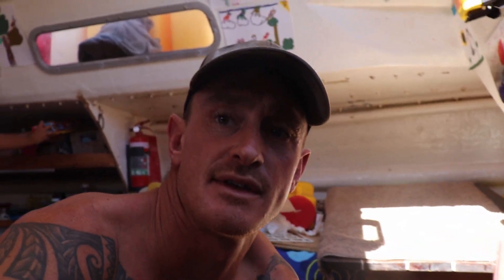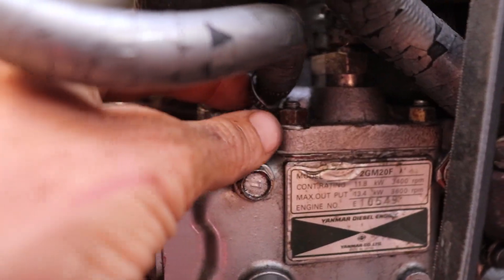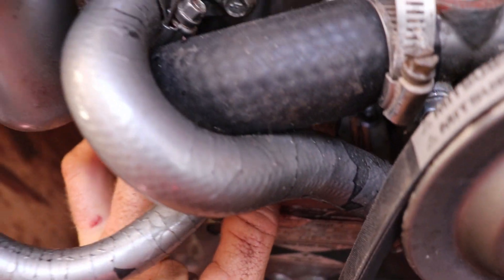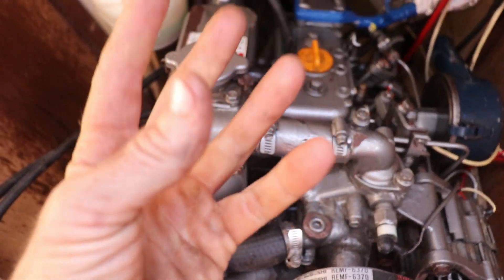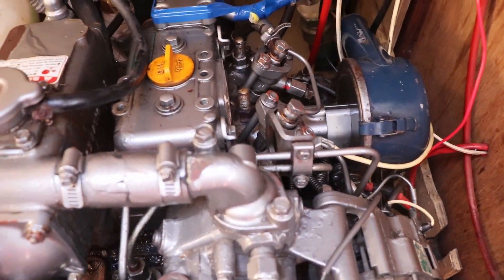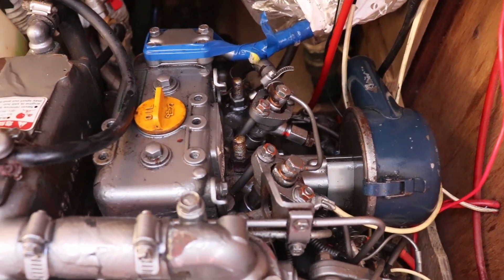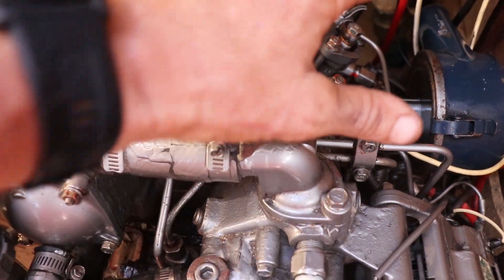So this is the basic rundown that I didn't really include before. When we had the runaway motor coming into Exmouth, I thought it was the injectors and the fuel injection pump. On these little Yanmars, that's the fuel injection pump - this thing under here - and you take those four bolts off. You've got to take all your hoses off, your fuel lines, and you take that fuel injection pump out, as well as the fuel lines and your injectors, and you send them away to get refurbished. And they ideally send them back fully refurbished and ready to put back in.